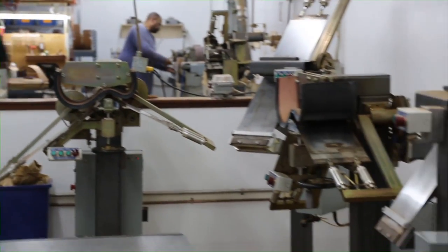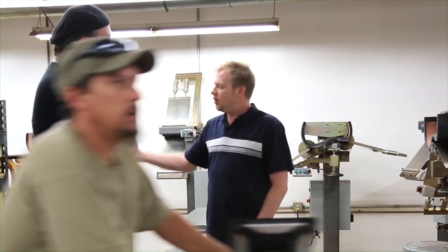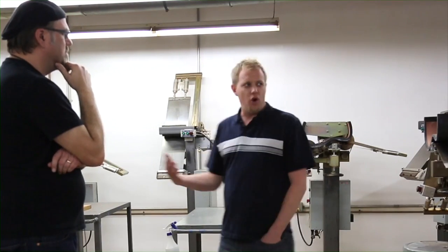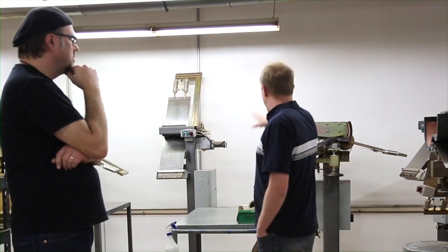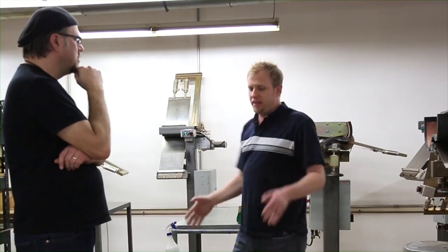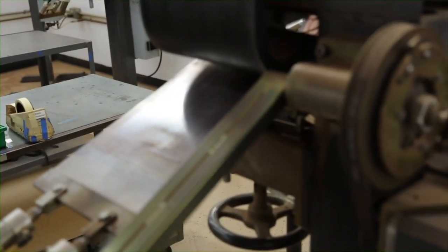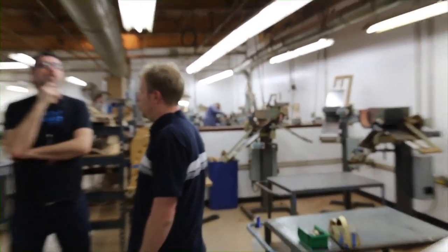This is standard procedure — we're typically successful with most guitar species, needing only about four to five minutes to cool down before we can pull it out and it'll hold the shape. Not with all models though. Cocobolo is so oily you can pull it out of the bout bend and it will just flop around like a piece of taffy. So a lot of times with those, we'll get it out of the mold and even put it into the blocking mold and let it cool down there to help hold the shape a little better.